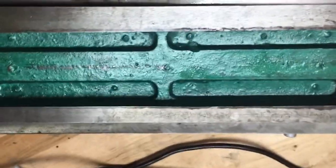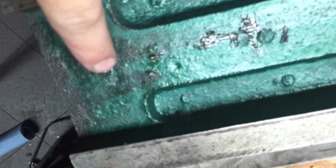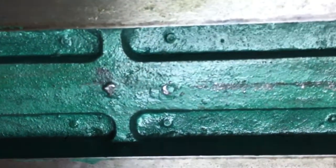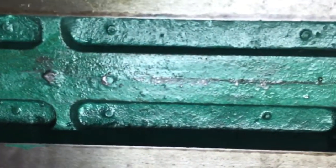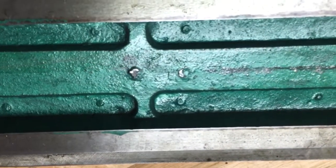I've removed the tray and you can see here where the ball screw's been rubbing against the bottom of this here, and I think this nub is where it's really catching. I see another one down here at the very end but I don't think that'll come into play, but I think this is what's causing my problems — this high spot right in here. So I'm going to have to take a die grinder and groove that in slightly, just to make that as even of a surface as possible.